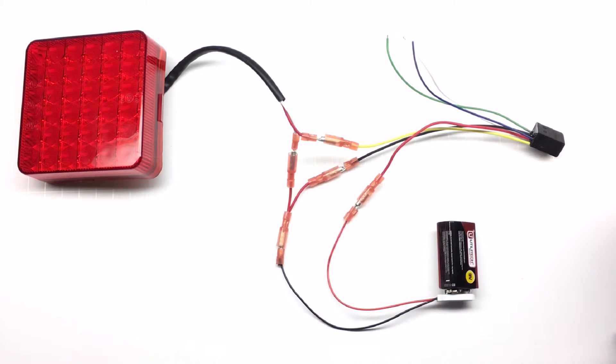You can also use this module to supply an impulse or non-latching signal. It can range from a really short 0.1 second to trigger something, to a very long half-an-hour signal. You can even use it to power up some devices for a period of time by just pushing the button.